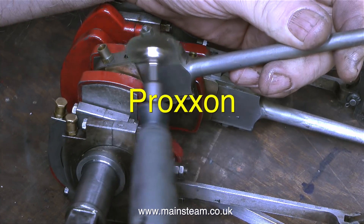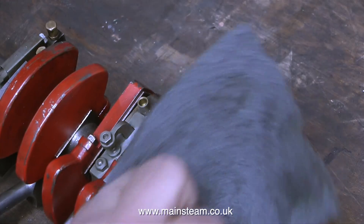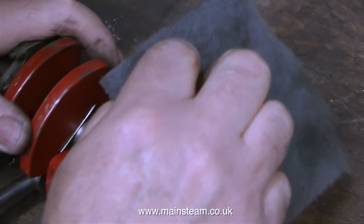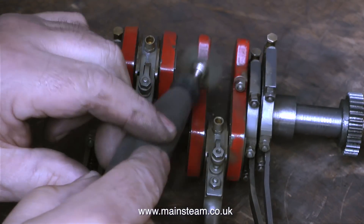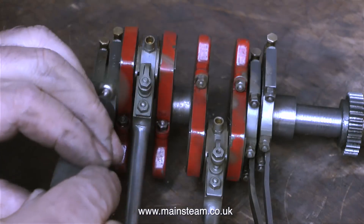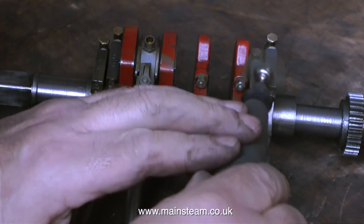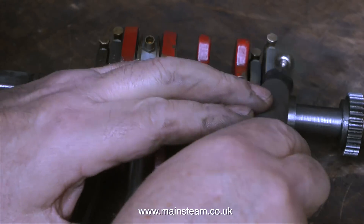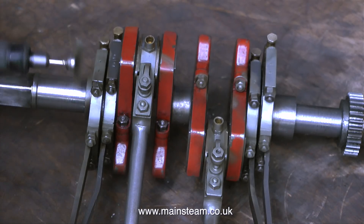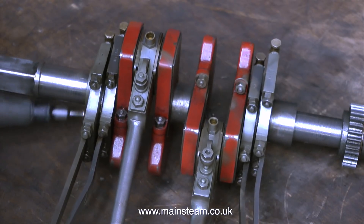A serious health and safety warning. If you're using one of these wire brushes that fits into the Dremel, your Proxxon, or whichever kind of rotary tool you have, it is absolutely 100% essential to wear eye protection. I'm not kidding on this one. And keep the speed down. These small motor tools go very, very fast indeed, and it's not good if it's spinning too fast because what happens is the brass bristles fracture and come straight at you at an alarming speed. Hitting you in the face is bad enough — you can feel them pinging off your forehead. So maybe a full face visor is a good idea, because without eye protection it could be a very easy way to get a nice guide dog to keep you company.